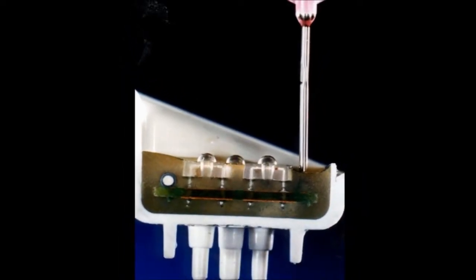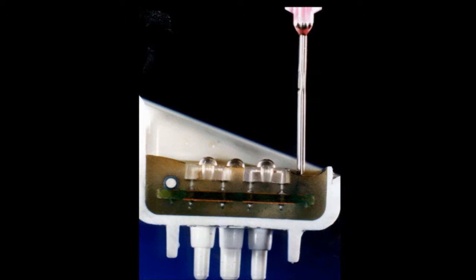One of the other things that can happen during the potting process is bubbling. These bubbles typically don't occur if the resins have been properly degassed, which takes place during the pouring of the resin. But if there's residual contamination on the surface of any part, it could actually act to hold bubbles. And once those bubbles break free, it leaves behind a pore or a void, and those voids can be a real problem, especially in terms of electronics and the potential for contamination. If you remove the organic contaminants by using the plasma, then the potential for this bubble formation is all but eliminated.